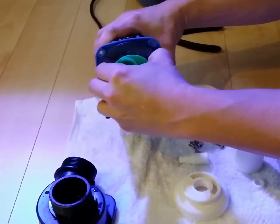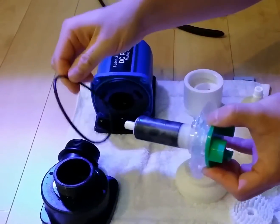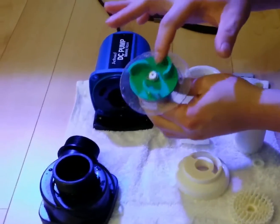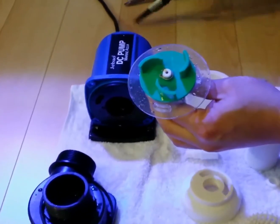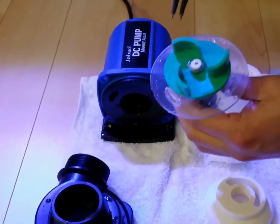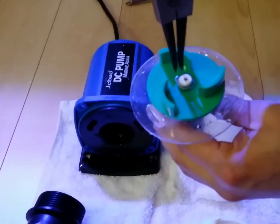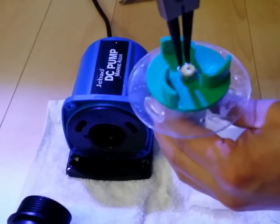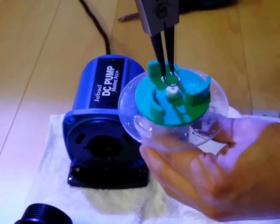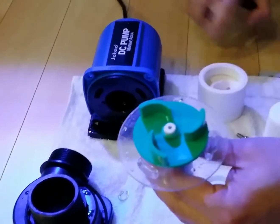Pull out the impeller and keep an eye on your O-ring seal. You'll see there's a ring retention clip, so you need to use an external ring plier to remove it. Be careful — don't exert too much force, otherwise you'll need to use a plier to bend it back into shape before you put it back in. Just exert enough force to take it out and keep it in a good spot.